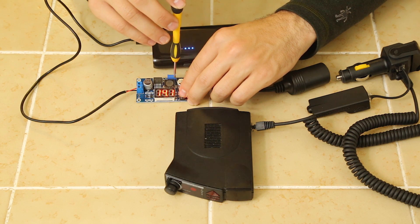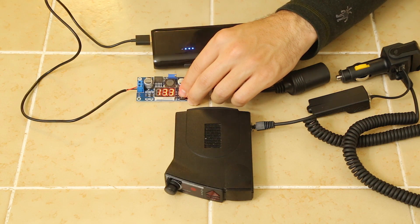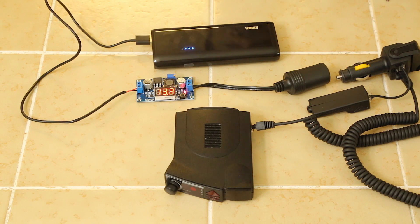According to the manual, the V1 — just as a sample detector — can accept 11 to 16 volts. So I'll set it to that range. 13.3 volts. This guy can accept anywhere from 11 to 16, and it's comfortable with that. I'll put it right around where an alternator would be, so 13.3 volts.